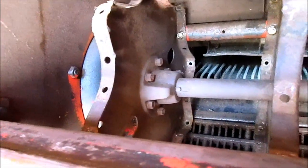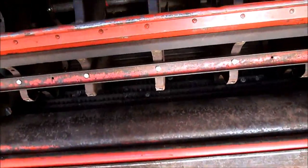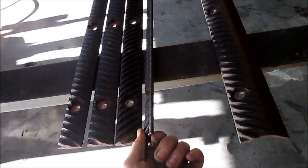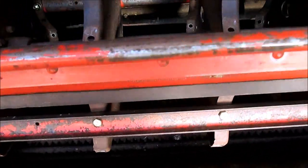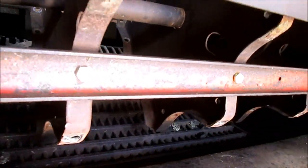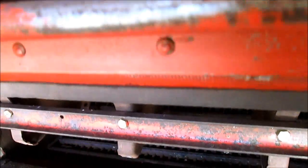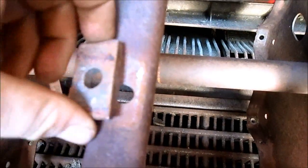I don't know if these were balanced, but there were 2 bolts that I had to blow with a torch, and I could also tell that I still had the correct sequence because under the flat small rasp bars that never seem to wear, they're flat on the backside, there are these small rounded spacers to follow the contour of the spiders, whereas these broken pieces of steel, they were made in a break, were rounded on the back.